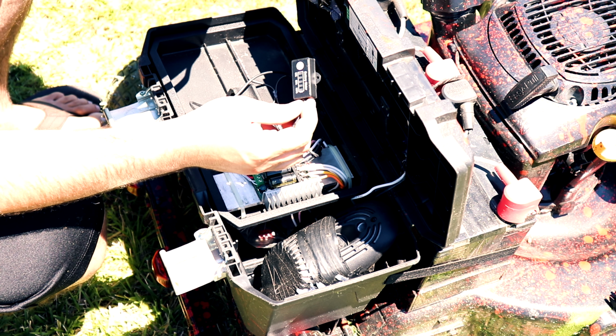One thing, if you're ever building one of these, this will ruin your sidewalk. If you're driving on a sidewalk with this, these embed into your sidewalk and basically dig holes. Noticeable too. So I would be careful. I put these on because the wheels slip, especially when the lawn gets wet, moist, and the wheels start slipping. They work very well, but to drive them on the sidewalk, be careful.